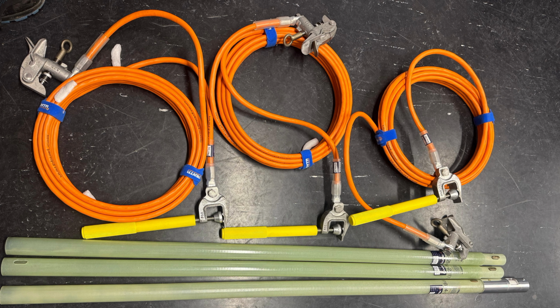During the maintenance, the transformer must be fully isolated from any source of power. But as you know, residual or induced voltage can still remain in the system. Drain earth provides a secure path for any trapped charge or static electricity, ensuring the equipment is safely earthed.